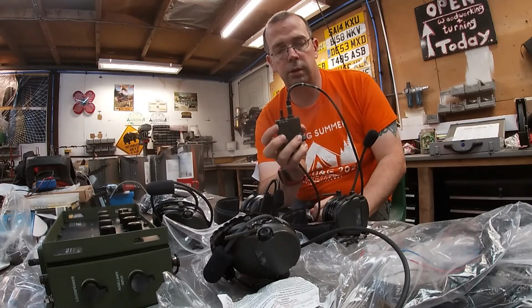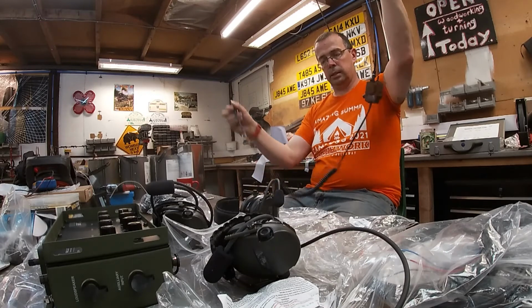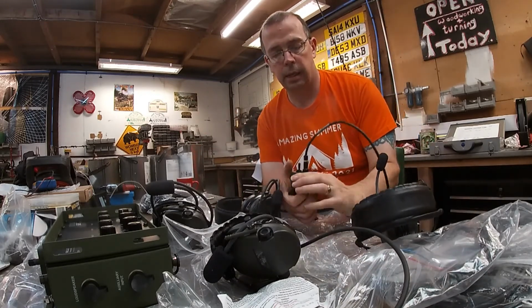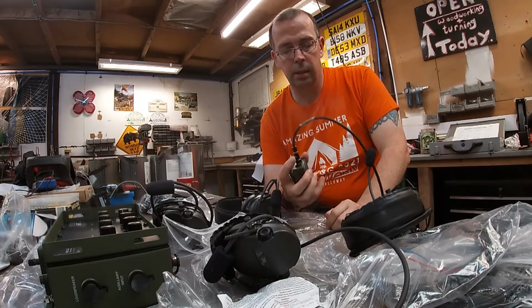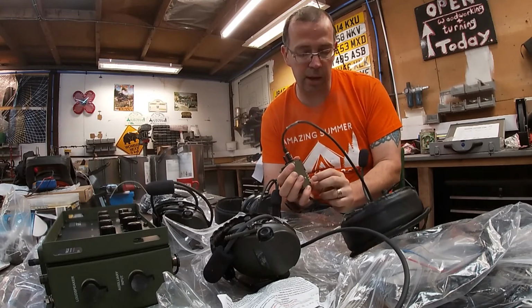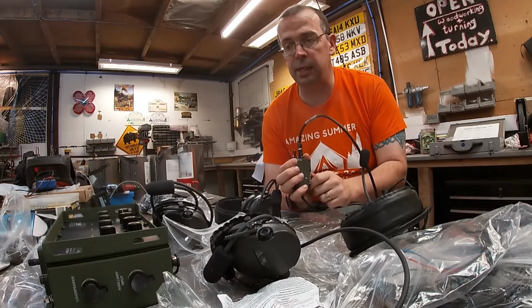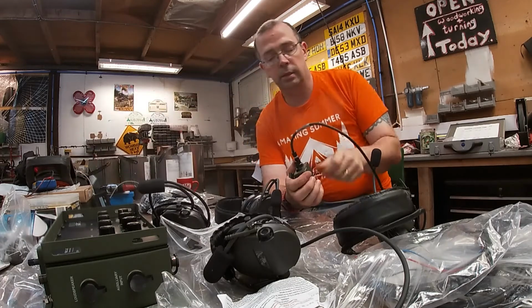Okay, so it goes straight in there like that. So that's headset all the way to the box. Okay, our Pressel here, a 2-way switch. You pull it towards you, towards the TX, and that lets you transmit on whatever radio you have this dial set to, A through to E, which means you don't need to be anywhere near the box. You don't need to touch any of the things on there.